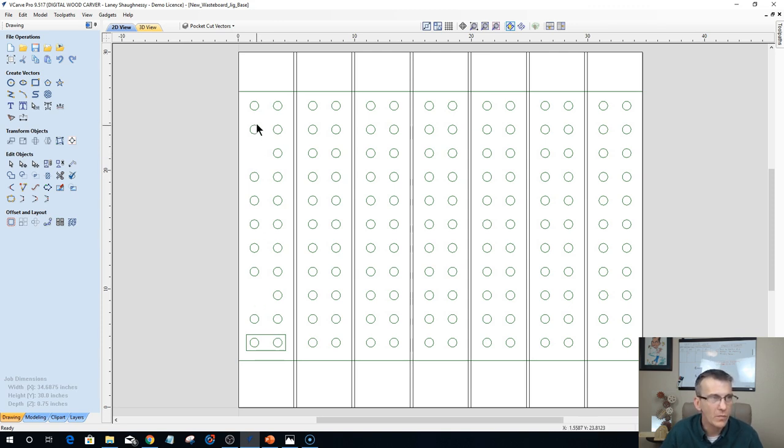And the holes, all of the pocket holes and everything, are 2 inches on center. You'll notice there's a hole missing there, and there's a hole missing there. For my table, I have the joint maker jig, and where that space is, where that hole would have fallen, I have brass inserts that hold my joint making jig. So I removed those holes from the design so nothing got milled there. They were irrelevant anyway, I didn't need them there.